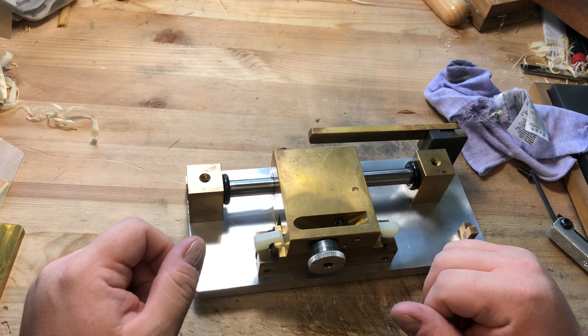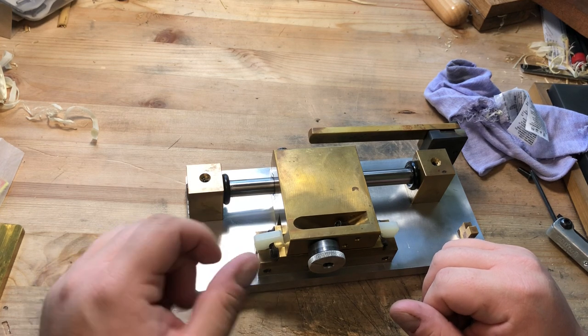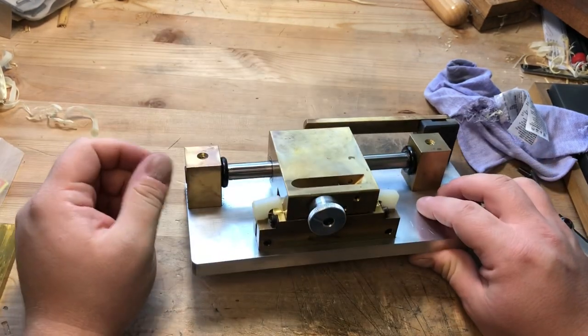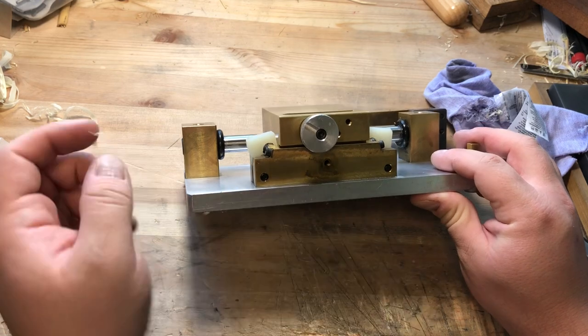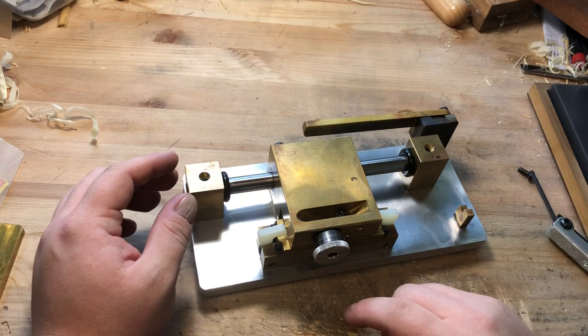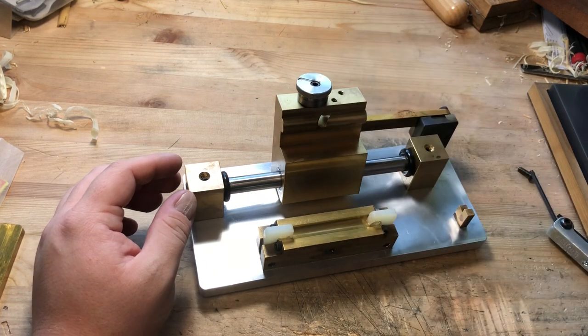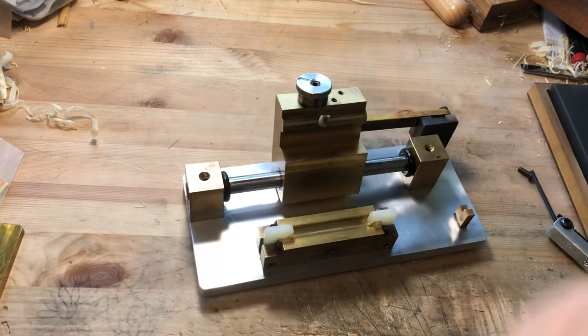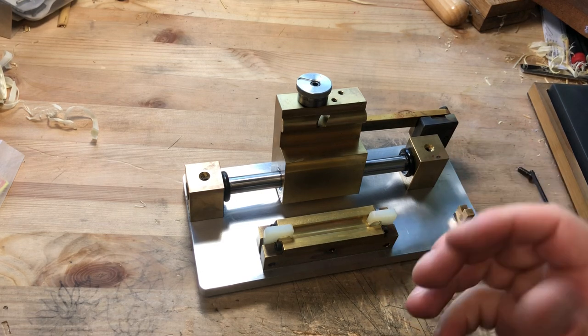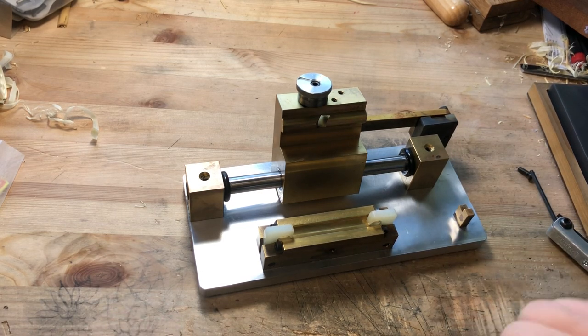It's really pretty simple — not super difficult. Honestly, the hardest thing about it is gripping this tightly so that when you tighten the screws, things don't wobble. Just a word of caution: when you are tightening screws on anything, but particularly a nice fine tool like this, don't over-tighten them. I've made that mistake before and been very sad that I did. Just tighten them until they're secure. Don't crank on them. Don't try to prove how strong you are.